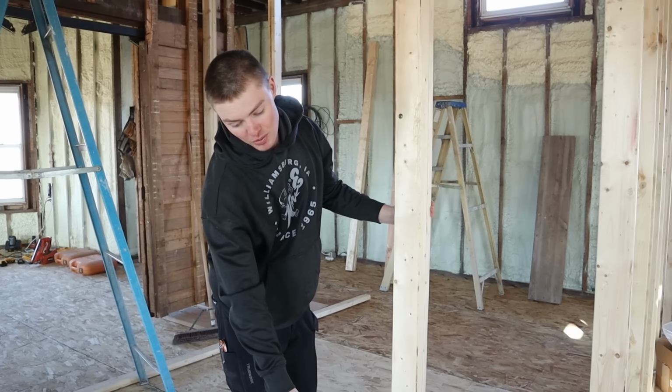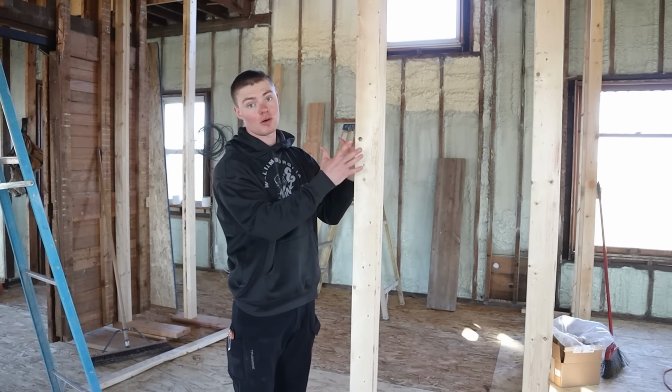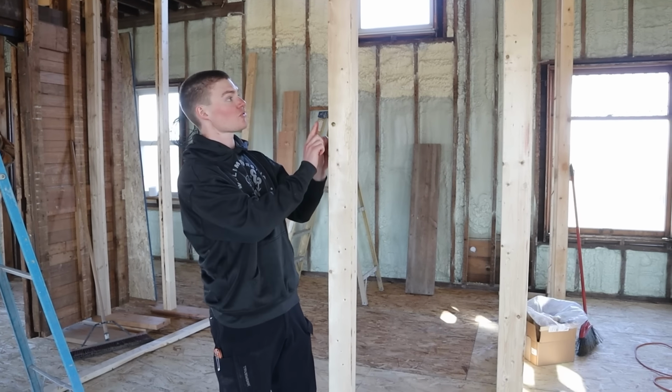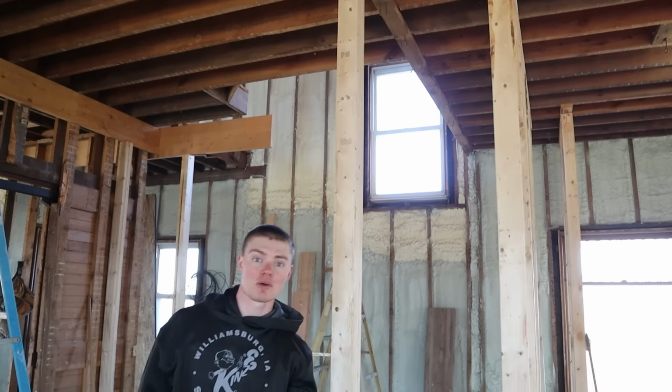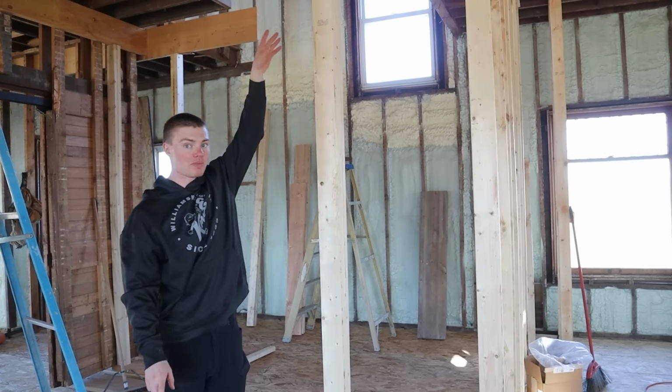Because if we ever want to address this low spot in the floor and we lift up on the floor while we have a wall already built, it is simply just going to transfer this board higher, which pushes the floor upstairs higher, which pushes the attic higher. So it just makes more problems up above us.